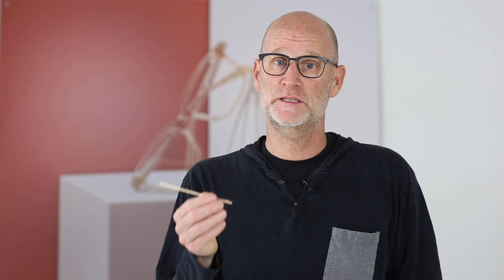A wire core needs to be inserted into the temple shape. This wire core is required to help the temple hold its shape and allow the optician to custom fit the temple. At Orgreen, we use custom wire cores that allow the designer to give a custom pattern to both the inside and the outside of the wire core material.